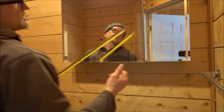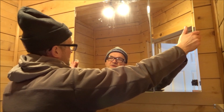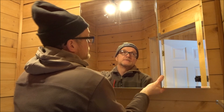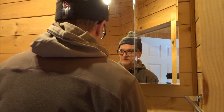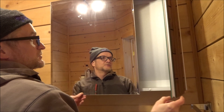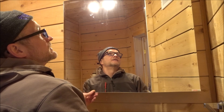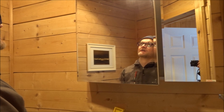To get it centered on the sink it needs to be three inches from the wall — that's five inches right now. The beauty with this mounting bar is that you have some lateral movement, so you can slide it side to side. Getting it dialed in — about another inch over — and it's still up there holding. That looks good. Cool — soft close. Let's see if it works on the big door too. Neat.